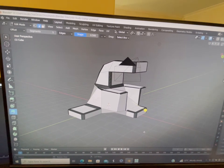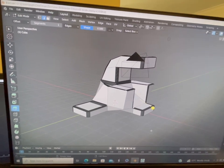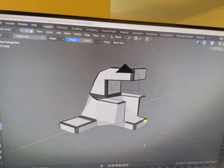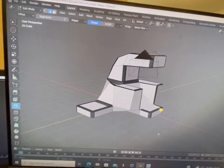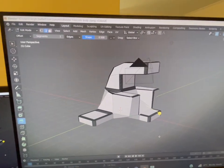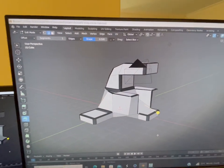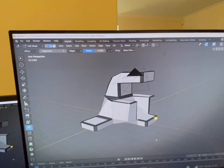I made the part in Blender. I'm reasonably happy with it. I haven't put holes in here because I wanted to drill it to size — that's a custom choice whether you want a 3mm bolt. I've done a 4mm bolt. It's probably overkill, but I don't want the bolts to rip through the plastic.